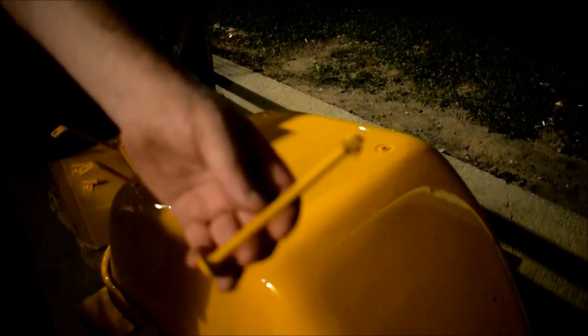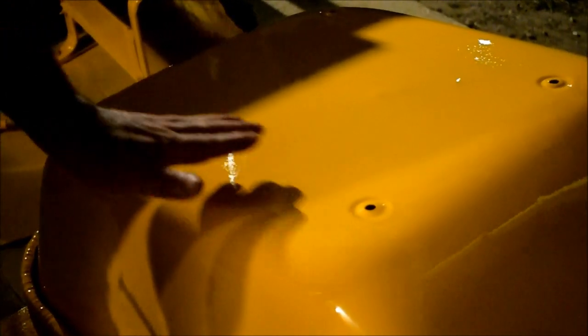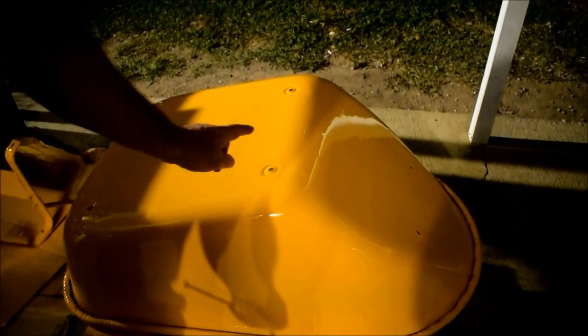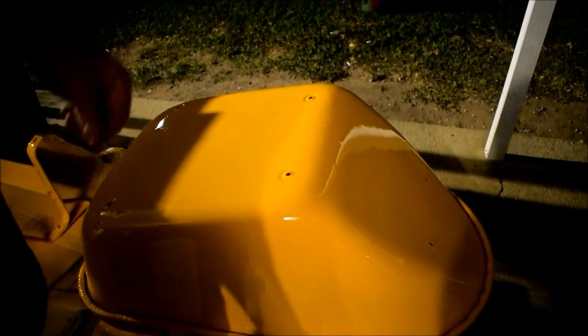Risers, obviously, take a longer screw, which I think is a 5.5-inch bolt like this. And this is about 5.5 inches. So that tells me that once upon a time there was a riser on here, which is a wedge-shaped piece of wood that rises up here and then gets narrow to the last bolt here. So the riser would stop here and then sit flush against the belly of the wheelbarrow. So the riser would rise up about an inch and a half, maybe 2 inches, depending on the belly height, whether you want it to sit level. Apparently this one had a riser going by pictures only.